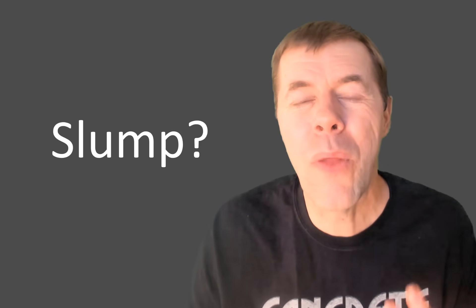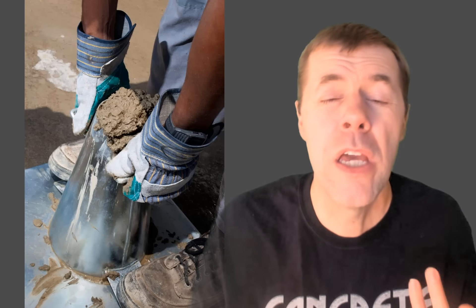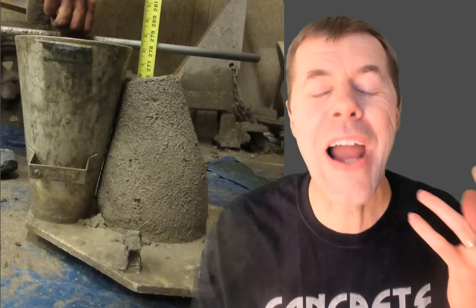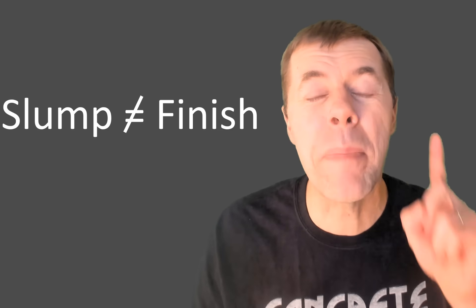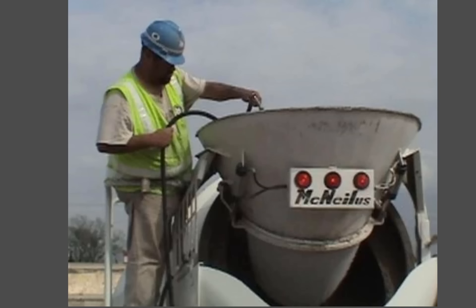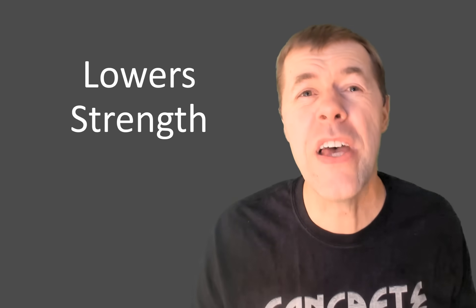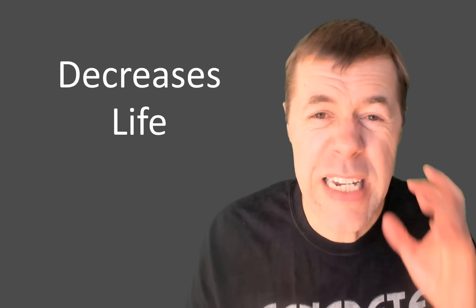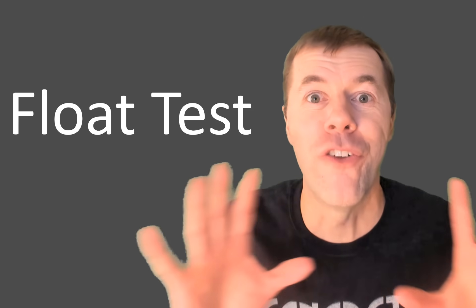You said testing — like the slump test? The slump test is cool. If you don't know what it is, you take a cone, fill it full of concrete, pull the cone up, and measure how far the concrete fell down. How far it fell is an indication of workability. But slump does not equal finishing. The more effort it takes to finish means more water has to be added — like this. Not good. Or somebody's spraying the surface like this. This hurts your concrete, lowers its strength, decreases its life, and causes spalling like this.